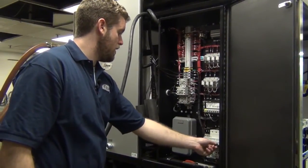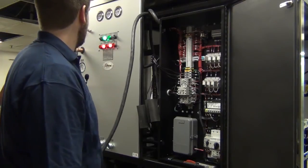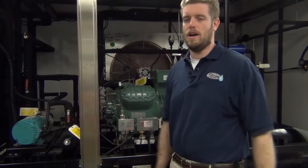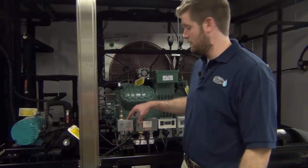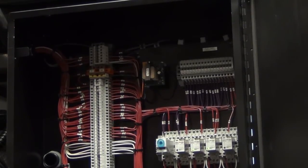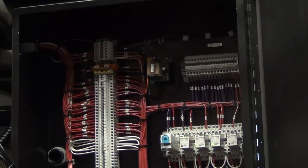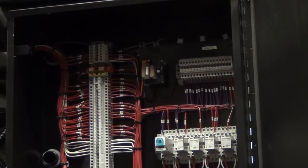Now finally we can turn on both of these breakers, turn on our pump, and sterilizer. We had a couple of alarms go off: an oil pressure failure and a service sterilizer alarm. To take care of the oil pressure alarm, which commonly comes on during startup, hold down the reset button on the oil pressure safety switch — you'll hear the solenoid valve trip, your alarm light should go off, and your compressors should start. To address the service sterilizer alarm, look to the UV sensor board inside the electrical box. This comes preset at the factory and shouldn't require adjustment; however, if it does, there's a sensitivity adjustment that can be modified with a small Phillips head screw.